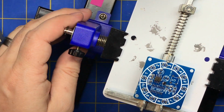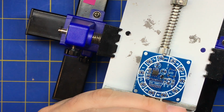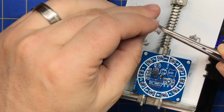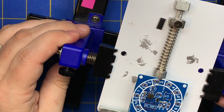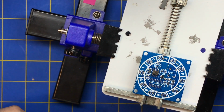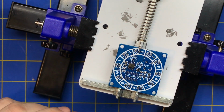U1. Now we're going to do U2. Microchips are U, I guess, for microchip. Sometimes they're IC. Usually it's U. Resistors will be R. Capacitors will be C. Inductors will be L, or I sometimes. Usually L. Transistors will be T or Q. Usually Q. And switches, S1. LEDs don't really have a numbering. They're usually diodes, so they usually just put a D for diode. LEDs are technically diodes, so that's usually how they're identified.